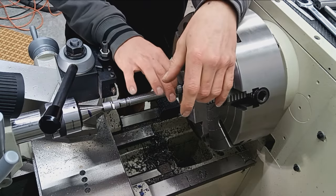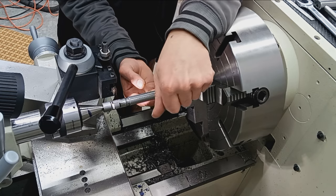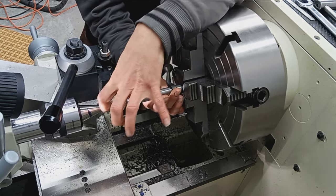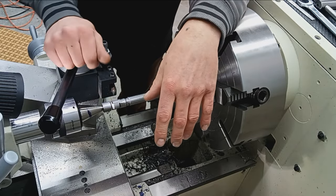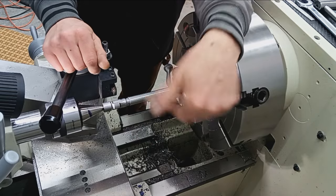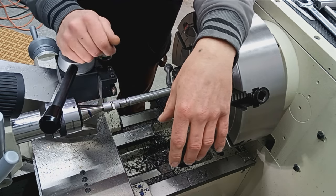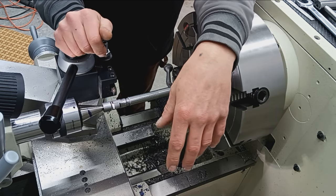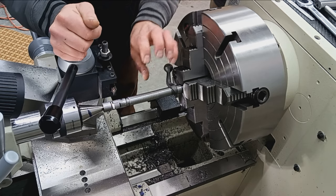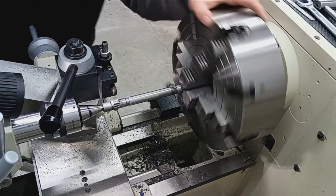That just means perfectly 90 degrees square with the new surface we machined. When the bolt sits in the action in the cocked position, it will have no slop — keeping the bolt 90 degrees straight and square. The bolt lugs will be touching the inside of the receiver 100% and square. They may require a little lapping but we'll check lug contact and decide. I always lap under trigger pressure just to ensure things. All the machining work on this section of the bolt is complete.